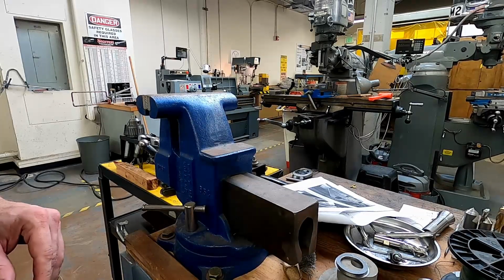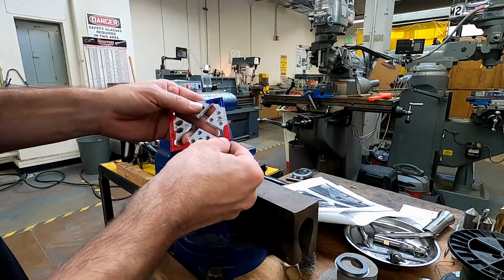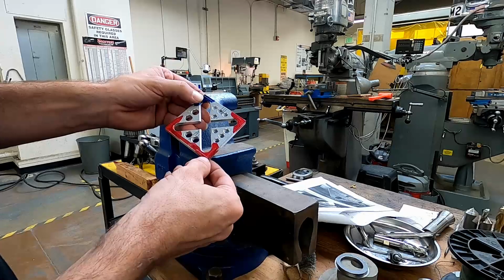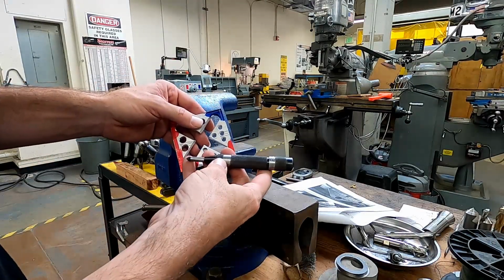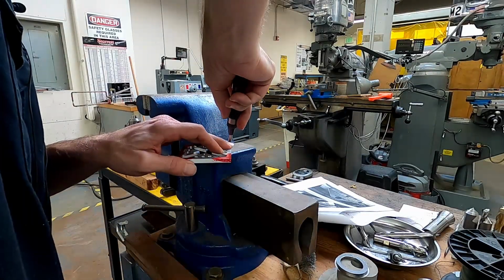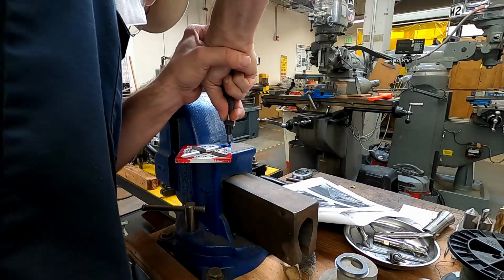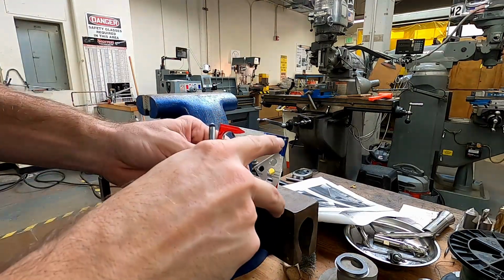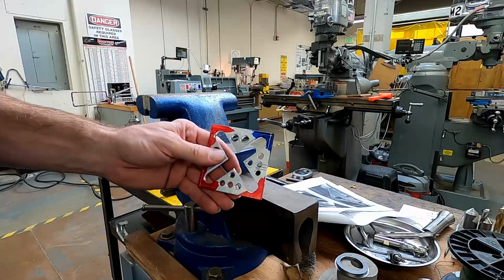Okay, now that we've moved away from the inspection plate, we want to go ahead and put some little dimples or some little start holes on these corners so that our drill bit doesn't wander as we start to drill that in there. There's 2 different ways we can do that. There's a handy little device like this, which is kind of a spring-loaded punch. We put this right on there. We put the point right at the intersection of those 2 lines that we drew. And we press down, and we get an automatic snap there. I don't know if you can see that or not, but we put a small little divot right in there, and that'll be a start point for our drill bit.